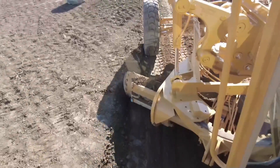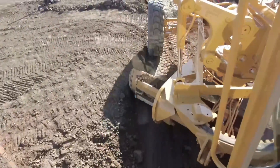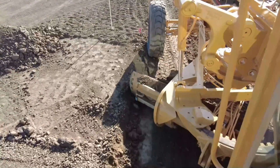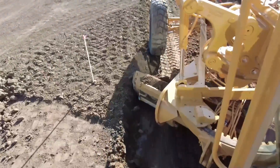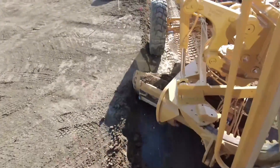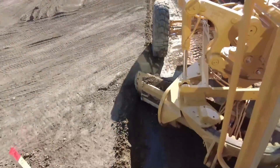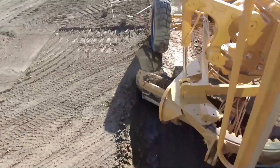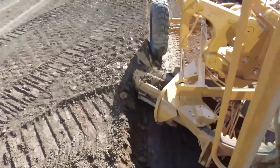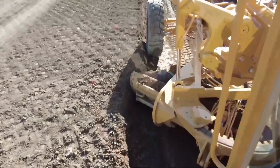Now I'm just going out to the line, taking the pink line out, and hopefully it'll be nice and straight. I don't have any numbers written on the ground right now. Quite normally I'll ask the grade person — or they'll do it automatically — to take the paint gun, measure, and write a number right on the dirt just in front of that lath, so I can guesstimate how deep to cut. In this particular spot there's no number yet, but they'll measure down and we'll put grading dots on the ground. That dot is what we'll use to put the boning rod on and actually measure up the street to pre-grade it — I'll talk more about that in a later video.